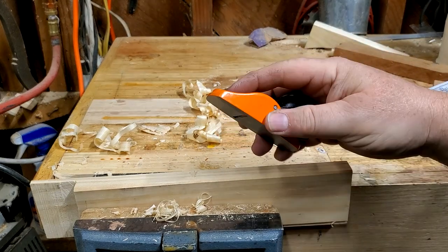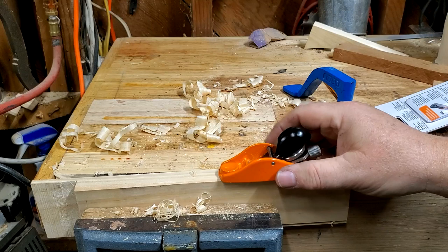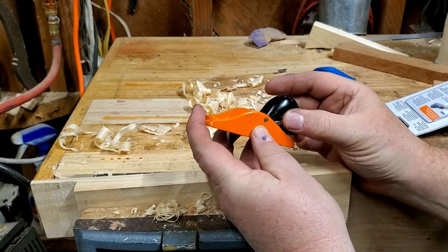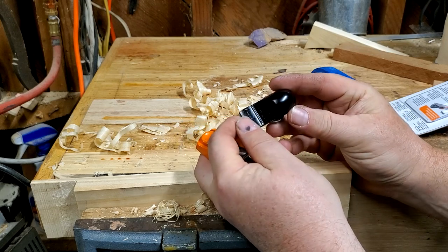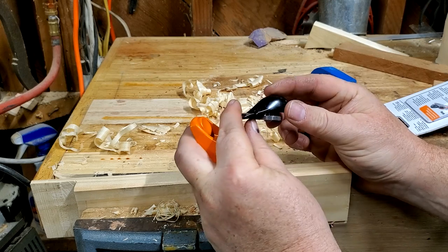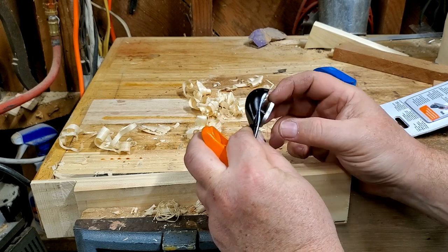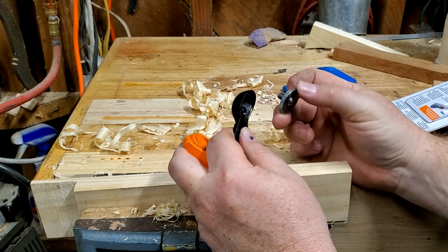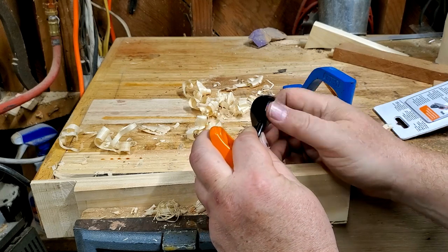Let's take a look at the construction. It has a little button or spot to put your finger — not really a knob, but just kind of a touch pad. It looks nice, though I don't think it's really necessary. It has kind of standard block plane construction, just in miniature. The cap iron here feels like pot metal, like a die cast — maybe a Zamak. It's light. The tensioning screw is pretty coarse-threaded, but it's pretty nicely made considering it's a very inexpensive tool.